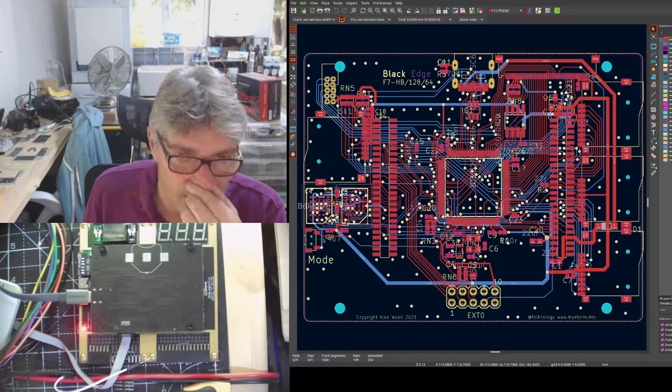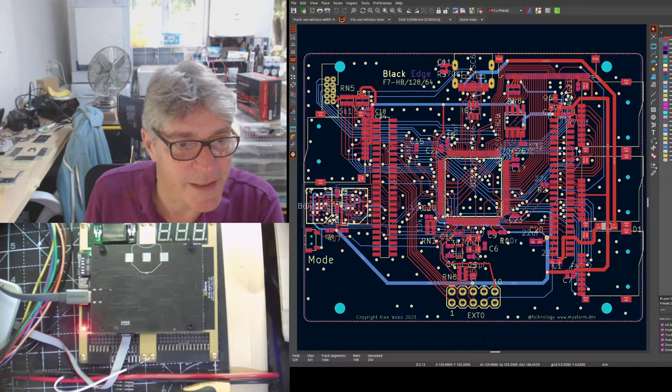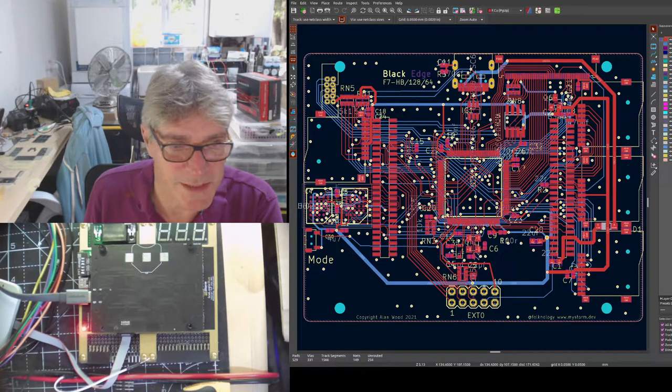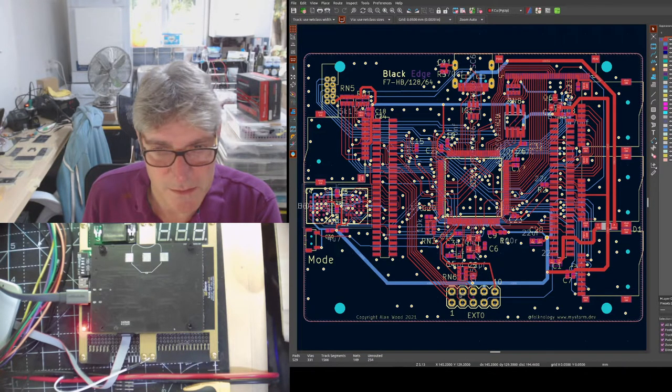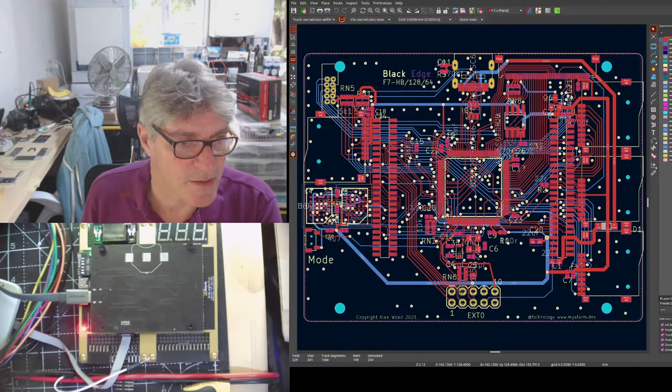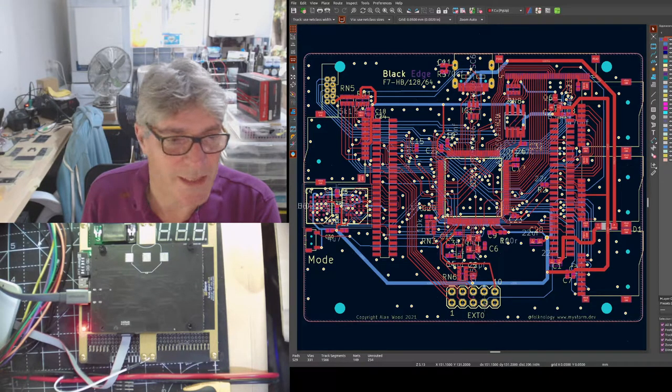So the other thing that changes then is what we do with what were the I/O connections for that blade, which you'll see these here coming down here. They now go to this header here, which is a right angled 0.1 inch header, which exposes those six I/Os that were connected to the blade, plus one ADC or mixed signal connector, which is connected to the STM32.